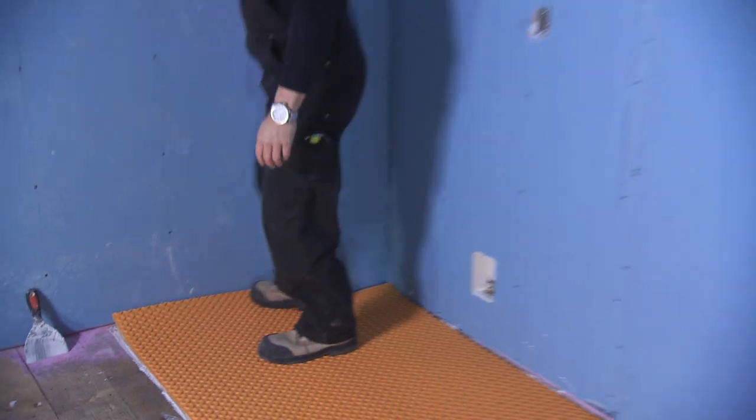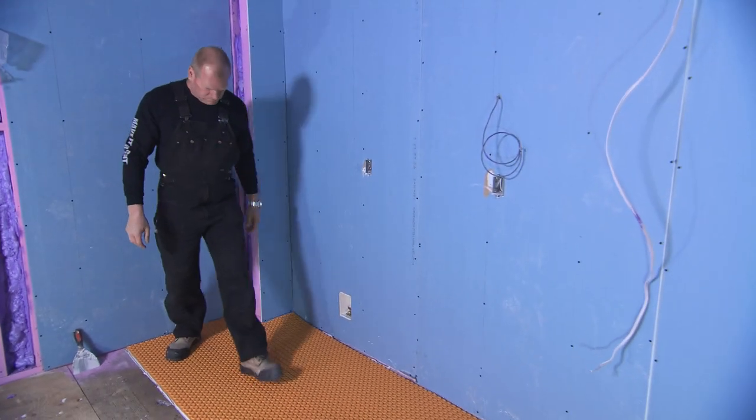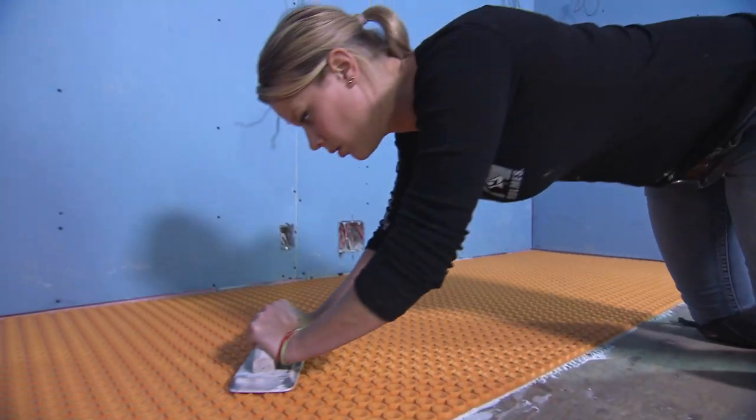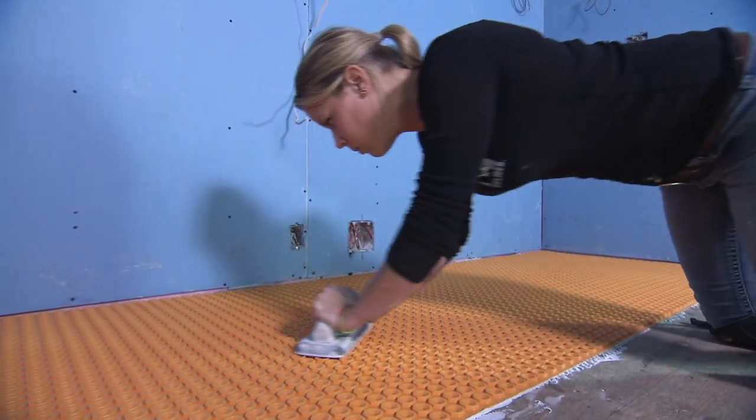Before, if I wanted to put in floor heating, I'd have another layer — whether it's a mat or cables — and it would be a little more thinset than the tile, which gives me a high transition to another floor. By removing that one system, it's a low floor. It ties right into a hardwood or carpet, nice and simple. The transition follows.